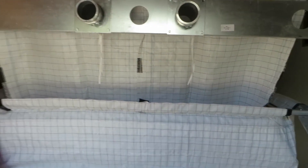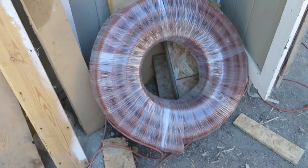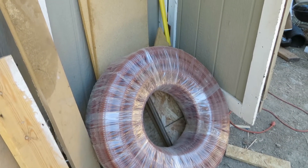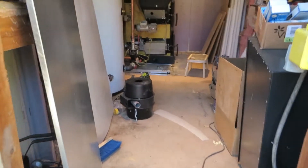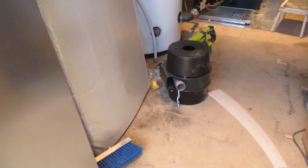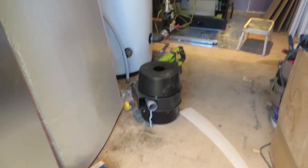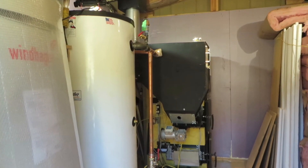Here in Montana we don't have bulk service for pellets. Pellets are delivered from that hopper via this tube — it's a PVC pipe. It has a copper winding in it for a ground for static electricity. Make sure you connect both ends. There's a turbine right there that will deliver the pellets from the big hopper into the side hopper on the pellet boiler.